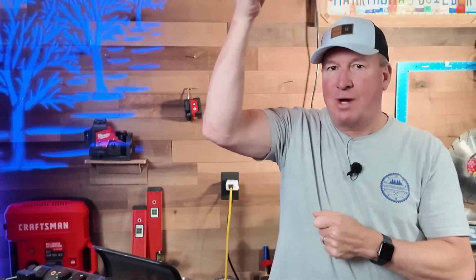So the other thing I want to point out is after you get everything tightened, turn everything on, always check probably at least for like a day and a half to make sure nothing underneath is leaking anywhere. I usually take a paper towel and try up high, down low, everything. Because if you don't see it just slowly creeping, then you might come back a week later and you'll see that bottom all warped. And that would be a real pain to have to replace. So I can just say from years of experience as a home builder, always check that out when you go to turn the water on. So then after that time period I mentioned of being very cautious, then I would go ahead and put everything underneath. But for now, just leave it open so you can see what's going on.